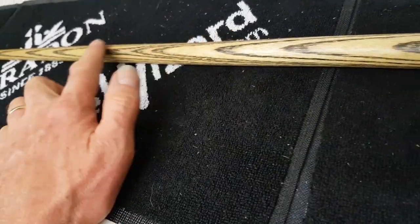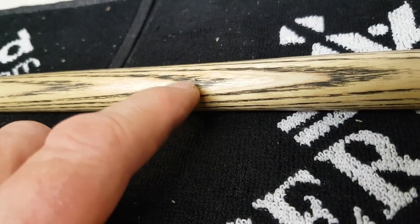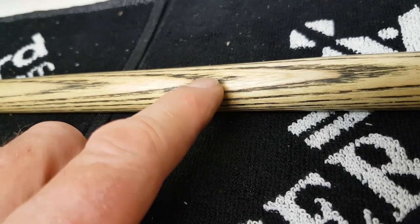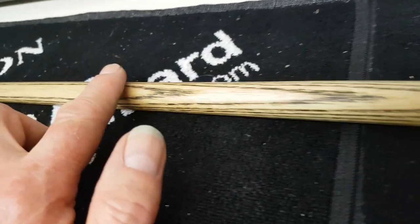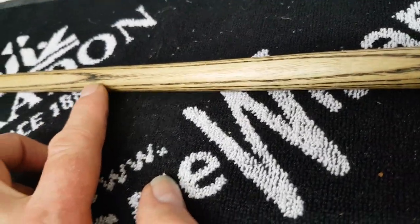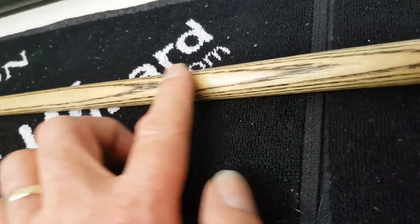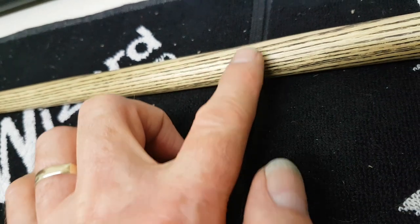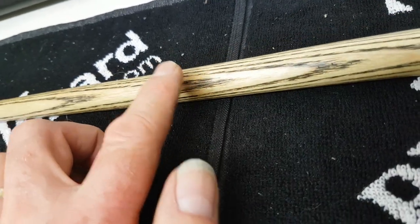Just rolling it over to the back — so you've got the front of the cue which didn't have any real issues for him. Obviously I could fill the arrows, but he didn't have too many. Most of it, as you turn it over, was the grain filler. The grain filler around these bits had all come out, making some of it pronounced — basically it was something you could feel. This was very pronounced — as you went over it, it became like a ridge. When you look at the cueing part, you had a ridge there and another one. If you run your hands up, you could feel it on these as well. The grain had come out, and basically you could feel everything — all of the grain lines and the softer, lighter ash in between. That had all sunk a little bit, so you had all different levels on the same cue.